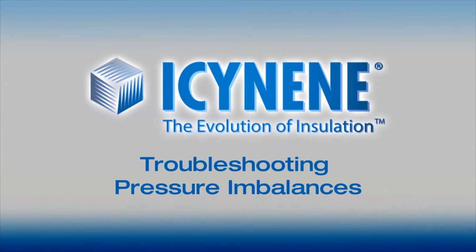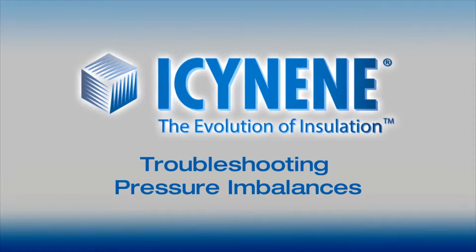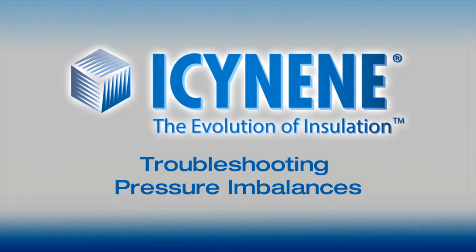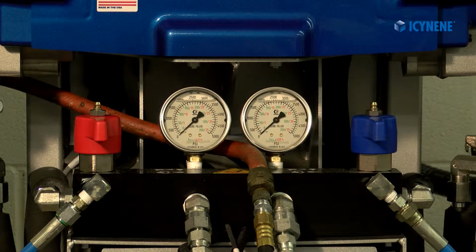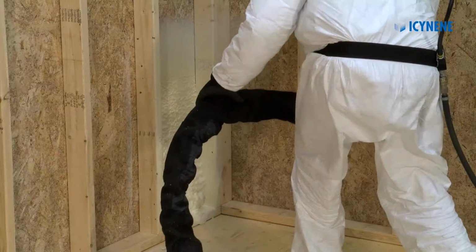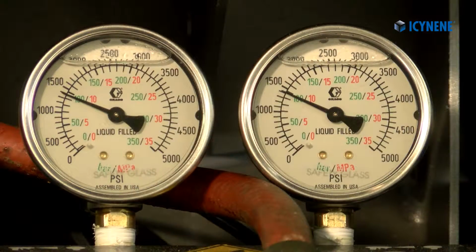In this Icynene training video, we will discuss how to diagnose and correct pressure imbalances so that your foam stays on ratio while spraying. When starting your machine, your A and B pressure gauges should come within 200 psi of each other during pressurization and should remain balanced while spraying to ensure that the A and B materials are being mixed at a 1-to-1 ratio.